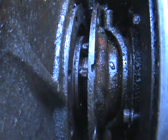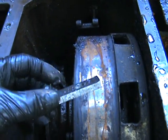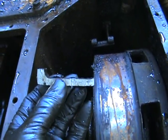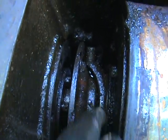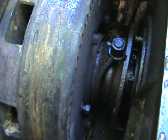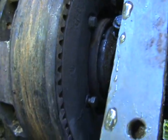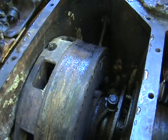For today, I'm going to finish taking those bolts out — they're safety wired, and on this side it looks like they used old hanger wire. Then I'll put in my clutch compressor tool that I just made out of some channel iron. That presses in the clutch spring so you can move it out far enough to lift it out. It'll be interesting to see if the clutch packs are seized up once I get in there.